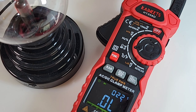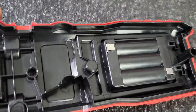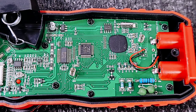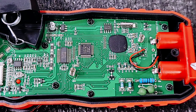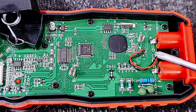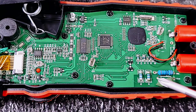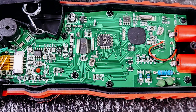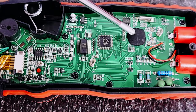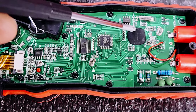Taking it apart — no shielding, though I kind of knew that was coming. Nice quality plastics, really good quality overall with very nice molding. The input jacks are soldered in, of the split type — the soldering is okay but not the greatest; I'd like to see those inputs soldered on really well. It's a high power resistor and two PTCs. No MOV though — hopefully no major transients. We have a transistor clamp, and the main IC is COB. Beside that, we have our EEPROM — the T24C08A — which leads me to believe it might be a DreamTek DTM0660 hiding underneath all that resin.